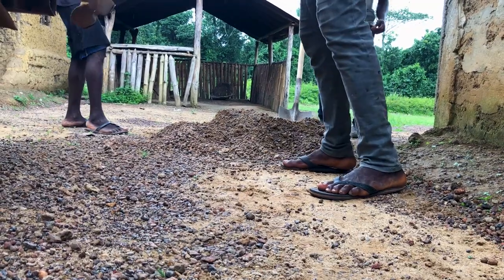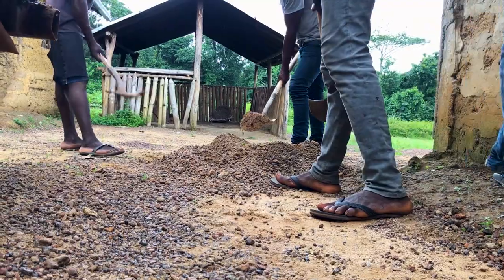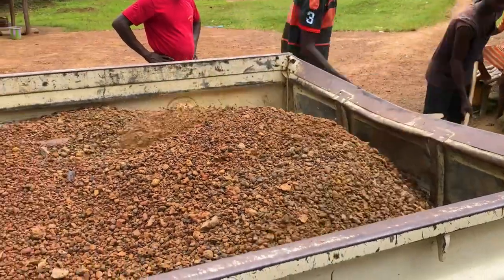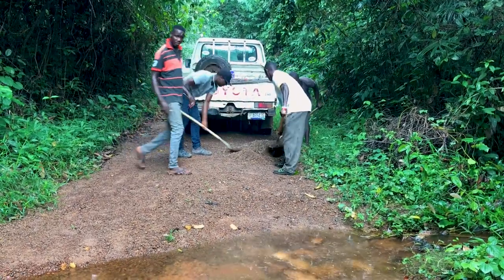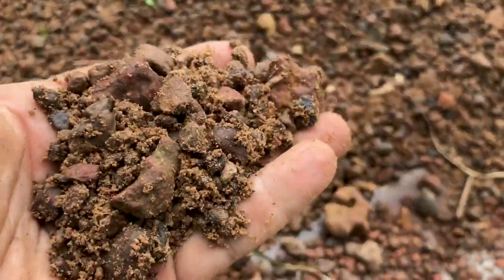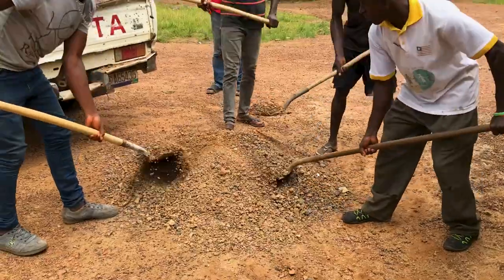The next item we needed is the aggregate. Out here we don't have access to professionally crushed rock, so we do the next best thing. We go out on the road or in a local village where rain has been falling over the months, washing away all the fine particles and clay from the laterite. The laterite is made up of gravel and a very fine clay. That washes away on road surfaces, so we go out with shovels and pile up everything from sand to very small rocks to rocks maybe the size of marbles.